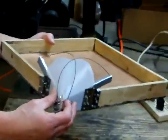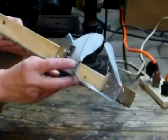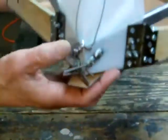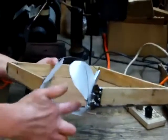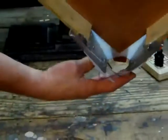A third problem was that I didn't have any convenient way to hold this closed. If I have a full tray or if I'm putting it away for storage, I'd like it to stay closed. So I made a little latching mechanism with stiff wire — this just goes up and down, and when I close it, I just pull that down and now it's latched. There was one other problem, which was spillage, especially with big parts. The way I corrected that was to have the polyethylene not just on the bottom, but coming up the side of the metal wing and over the top. So now what we have is more like a funnel, with a top part as well as the bottoms and sides.